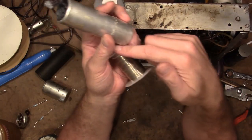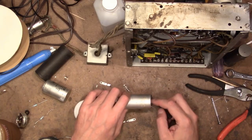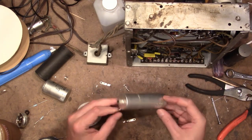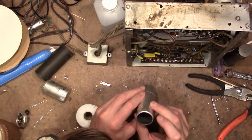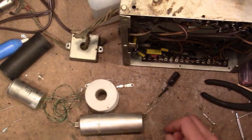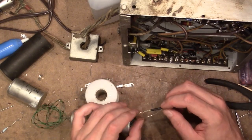The bus wire is threaded up through that hole so it's connected. The trick is to pull down on the bus wire while getting that anode to go through the center hole, which may be a little tricky, but I did a dry run before attaching the negative lead and it's possible. That noise in the background is a fan — it's a newer, less rattly one. It occurred to me this would be a lot easier if I attached a guide wire to the positive lead as well, so I just did that. It would also help to have a longer piece of thick bus wire for the anode, but I don't.